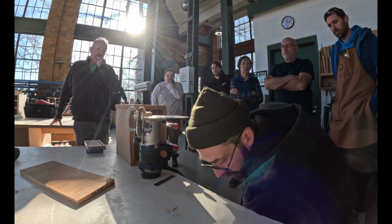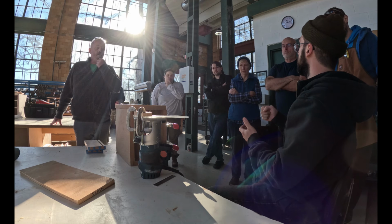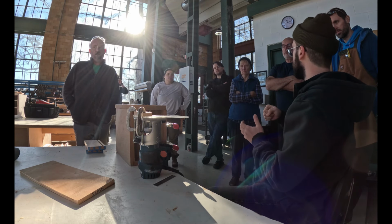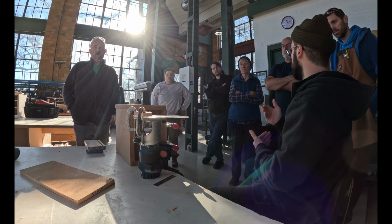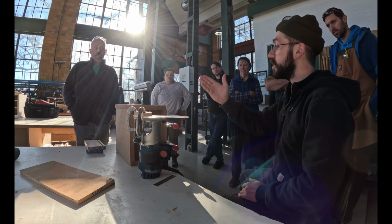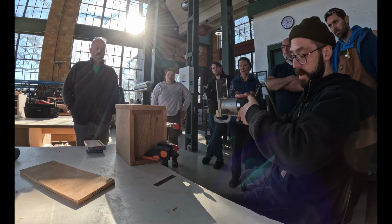The setup is kind of annoying, but once you're set up and if you've marked all your half lines at the same time, with the same measurements, once this is set up, it'll do all your drawer sides. So it can become very quick, right? So you get the blue tape on, you cut your curves, then you come to this stage and you're ready to start cutting with the router.